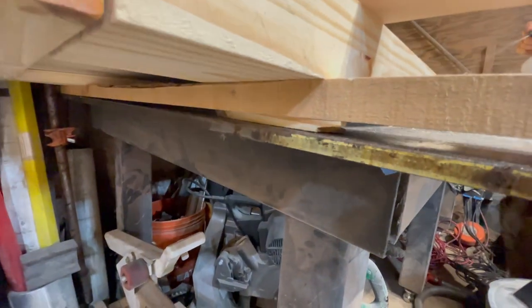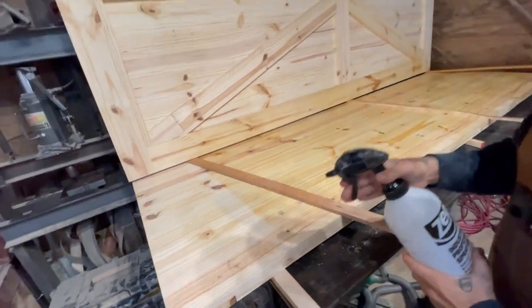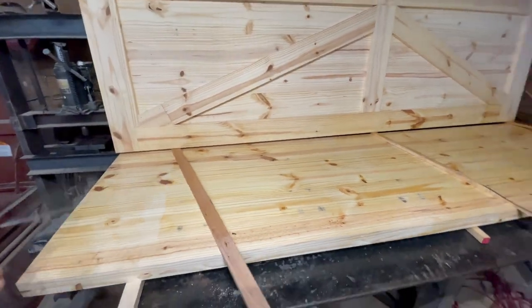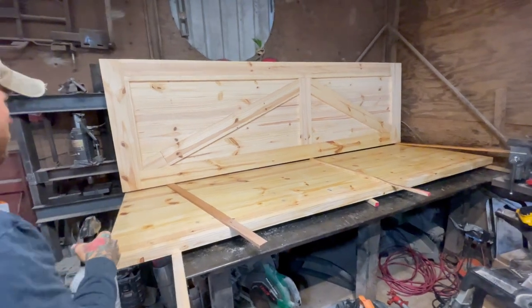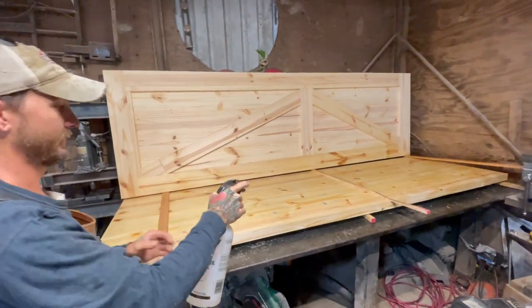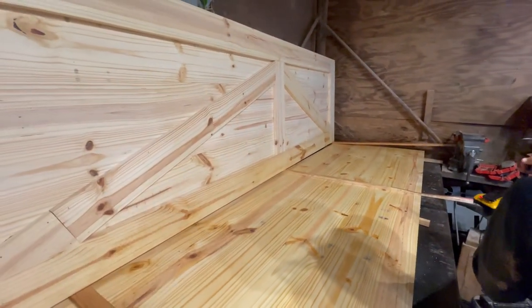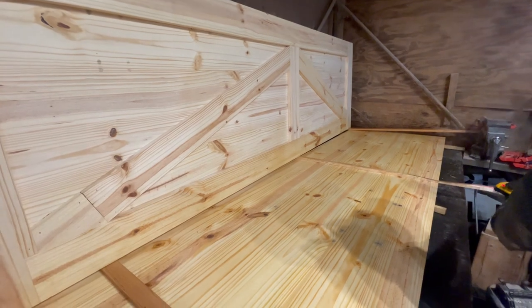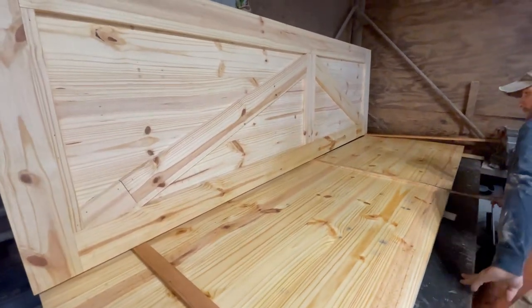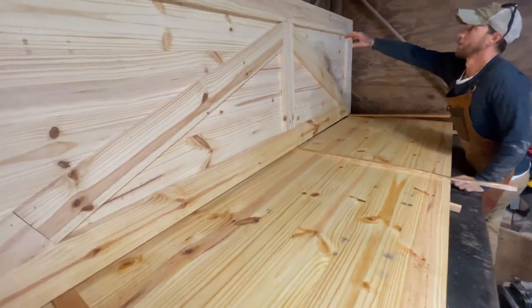We put little eighth blocks on the opposite way. And we're going to clamp her down super tight. And then hopefully when it dries, it's completely straight. Because the guy's been waiting on these for a while, but we don't want to turn in something that's subpar because we just end up rebuilding it. And if we did rebuild these, we'd rebuild them out of cedar, even though it's not kiln dried, because it's really stable and it doesn't warp. It doesn't do any of that.